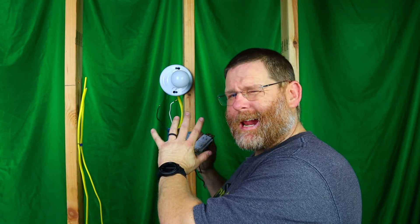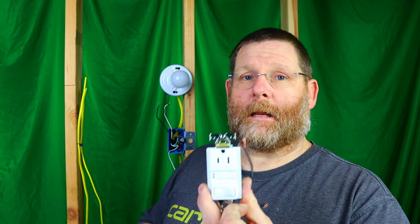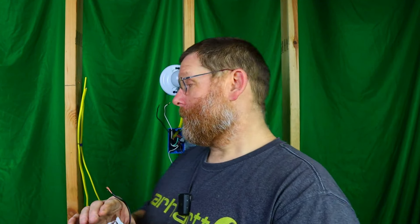So I've got a mock situation right here, kind of the same thing I had before. We have our power coming in on the bottom and our light switch legs coming in at the top. You would put this in if, say, you're in your bathroom and a lot of older bathrooms do not have a receptacle anywhere. This is an awesome option if you have a neutral in your switch box — but without a neutral, it will not work at all. Plain and simply, it will not work without a neutral.